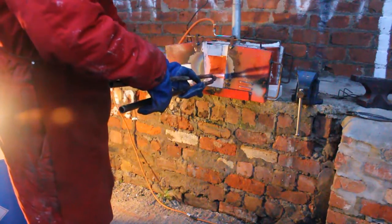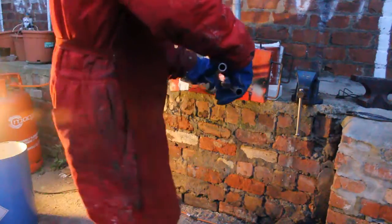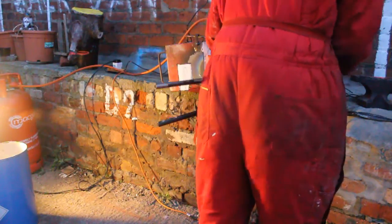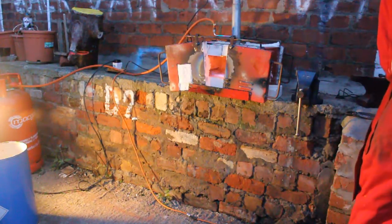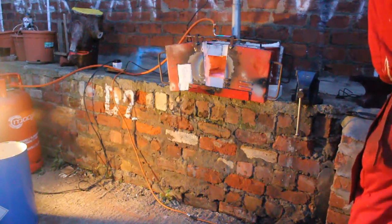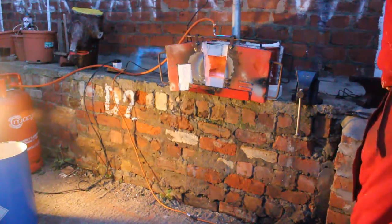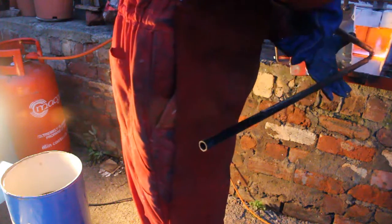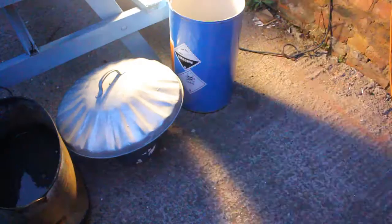Back at the forge, I first hammer in a maker's mark with a homemade die carved from an old cylindrical bearing. I weld it on a length of rod and use a hammer to bash it somewhat accurately into the metal. The next technique, used for replacing carbon lost during forging, I took from a video by Learning Connection, by dumping the blade into a bucket of sawdust.